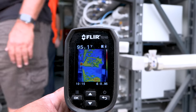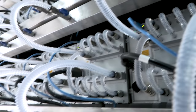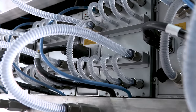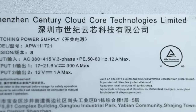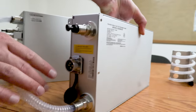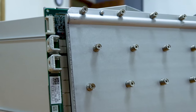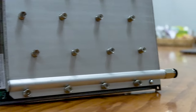The power supply itself is also cooled in this system. A unique feature is that this is a three-phase power supply — extremely uncommon. Most ASICs max out at around 240V, but these units take in full three-phase power, delivering balanced three-phase direct power. This allows the unit to normally operate at 5,500 watts and has an upper limit of 9,000-plus watts at 80% load. The thermal imaging shows the temperature distribution clearly across the cold lane of the unit.